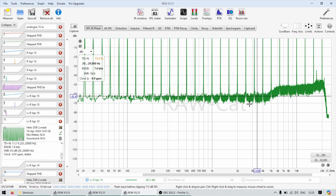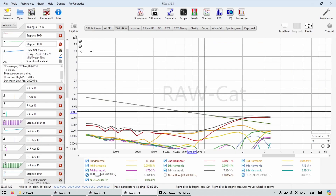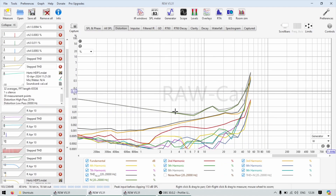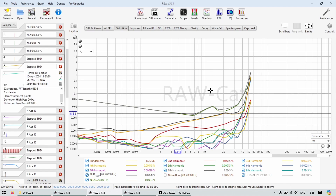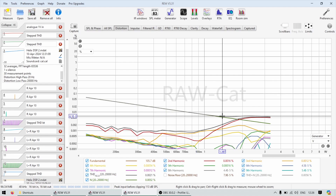I think this combination of amplifiers and DSP is going to work perfectly. The bottleneck is the Bluetooth adapter — if the owner wants, we might change it for something better, since he has a Pixel phone that supports aptX HD. But the match between the DSP and the amplifiers is perfect: THD below 0.1 for both, the DSP outputs six volts and the amplifier can take up to five volts, so we can keep gains down. Super budget and very very good. Watch future videos when we'll be installing and tuning everything — these are the measurements of the Hertz HDP4, HDP5, and Helix DSP.2. Thank you for watching!